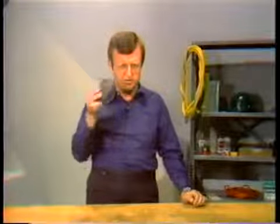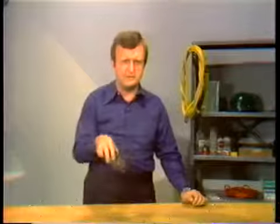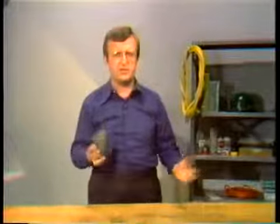There are still 4 other water wall problems we need to talk about: clinker damage, flame or fuel impingement, trouble with burner openings, and trouble with inspection doors. Now, clinker damage occurs when clinkers high in the furnace fall and hit the water wall tubes at the bottom of the furnace. This causes tube bending, crimping, and denting, and it also wears away the tube metal.